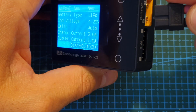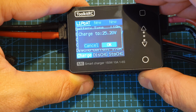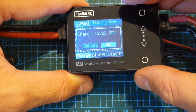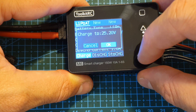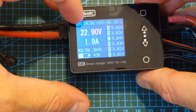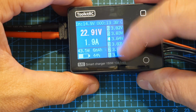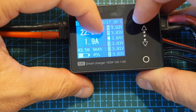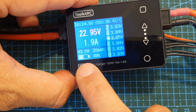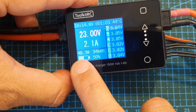Now I'm going to plug a 6S LiPo battery and try to charge it. Selecting charge for a LiPo battery, since it discovered the number of cells automatically, it's going to charge the battery to 25.2 volts which is 4.2 volts per cell. After pressing okay the charging procedure starts. On screen we can see the voltage of the battery powering the charger, a timer, the internal temperature, the voltage of each cell, the total voltage, the charging ampere, a charging progress indicator showing 49%, and the charging power at 48.3 watts.